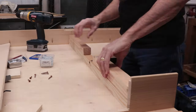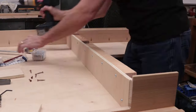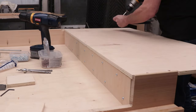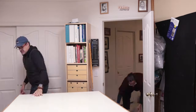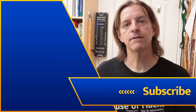Getting back to the project. Under the plywood, the tabletop has a skirt that is boxed in on each end. The boxes serve multiple purposes: they add rigidity to the whole top, they provide a mounting spot to attach the cabinets to, and they fill the space difference between the two types of cabinets. The bottom of the boxes are made with a thinner plywood and have T-nuts in them to attach to the filing cabinets. The thinner plywood also acts as a top in the serger cutout. After it was all assembled, I painted the main field and then put a polyurethane top coat over the paint, the edge banding, and the skirt. With a little help, putting it in place was simply a matter of taking out the old top and placing the new one in its place, and a bolt on each corner keeps it from sliding around. Join me in this video where I show how I made the table for my wife's sewing machine, and down here is a playlist of other sewing room related projects.